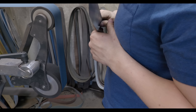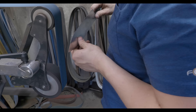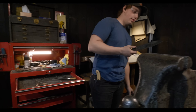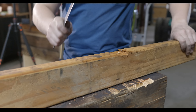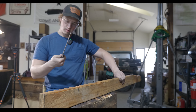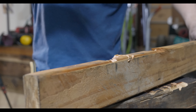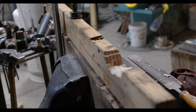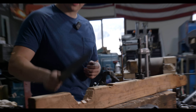With the utter failure of knife number one, I decided to leave the edge plenty thick on the other one, since I believe that was the cause of all the problems. So I left the edge at 30 thousandths of an inch and sharpened it on the slack belt — no convexing, just kind of a convex secondary bevel. I think this is extremely hard wood and the small points of contact were the issue. This one is holding up just fine — I think this sharpening makes a lot more sense.